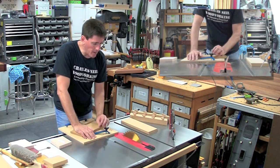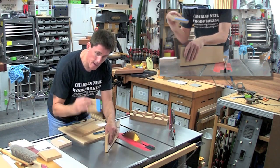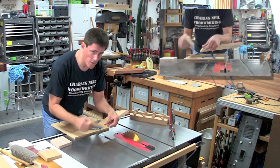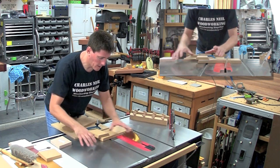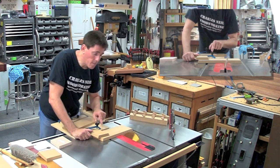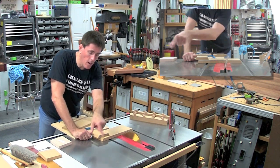So another thing to think about with the bevel angle, on any one of the corners, like in this case, the left side to the left back facet: anytime you have a mitered joint like this, the bevel cut on both of these boards is identical. So that also means that when we're looking at this from the top, and there are 8 compound angles on one side, there are only 4 unique bevel cuts on that one side, and those four are mirrored onto the other side.